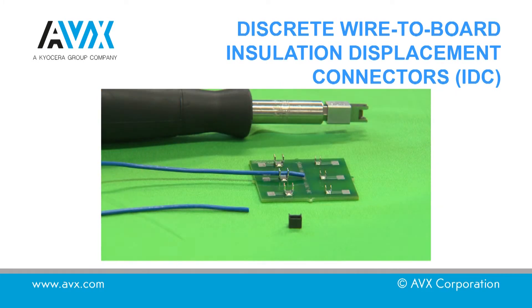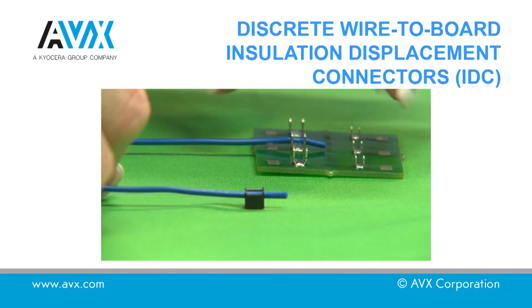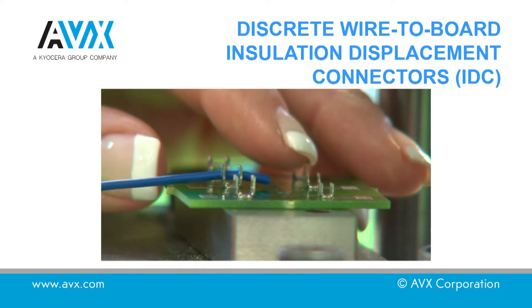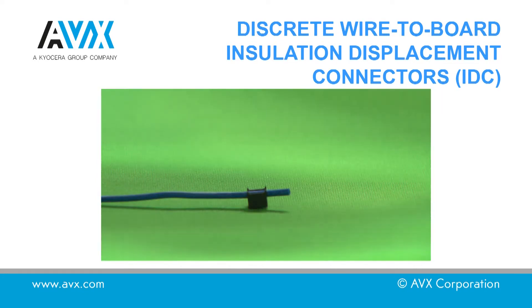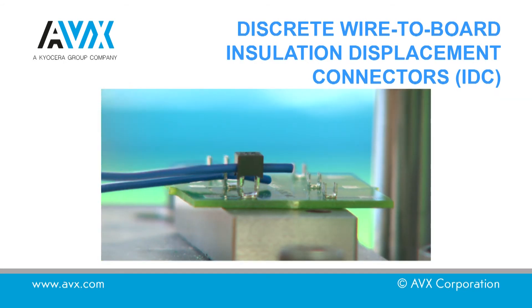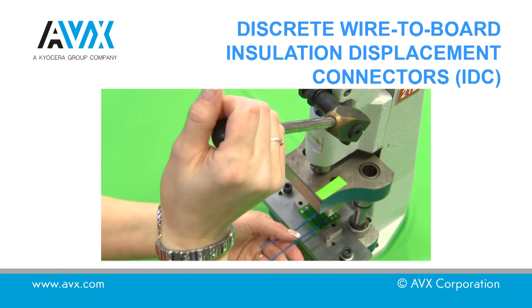The connection is complete. When using the cap for insertion, the following procedure should be used. Set the press height to adjust below the connector mated height. See the product drawing for the required dimension. Support the PCB underneath the connector to prevent damage to the PCB during assembly. Pre-prepare the cable by cutting to the length required if necessary.